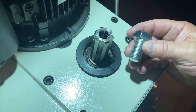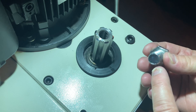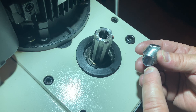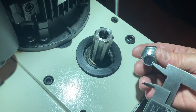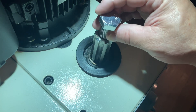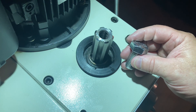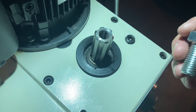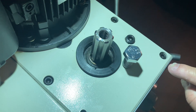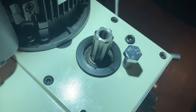That way the drawbar can go through it. Then I'll machine the end of the bolt and the bottom of the bolt just to give it a shoulder - a 2mm wall shoulder. So with the 10mm hole, the drawbar will be 14mm, giving it a shoulder of about 2mm. When I go to get the tooling out, the drawbar will be pushing up against this bolt with a 2mm shoulder to push against. The machining on this bolt I'll do off camera. I'm actually doing 2 bolts because I'm going to have a metric drawbar and an imperial drawbar, so I can use all my tooling.